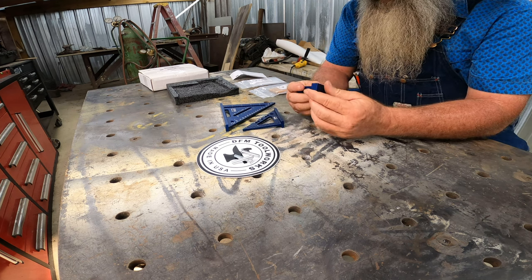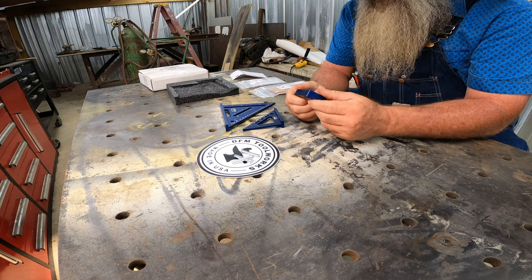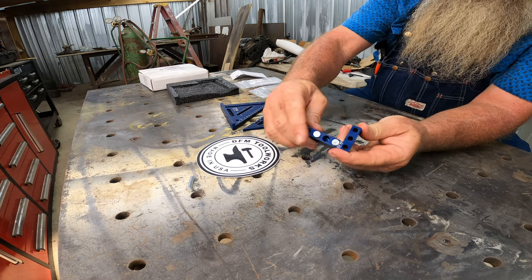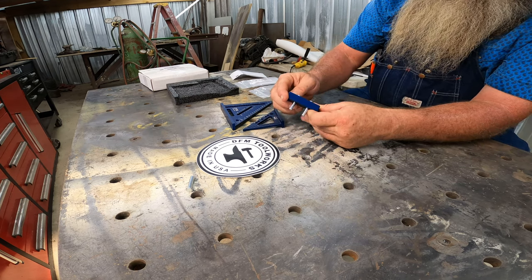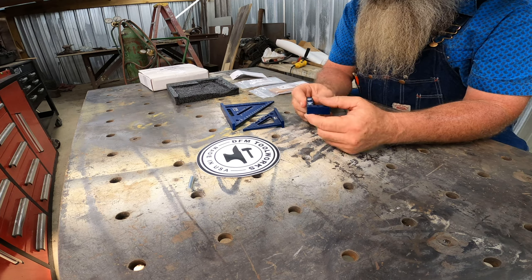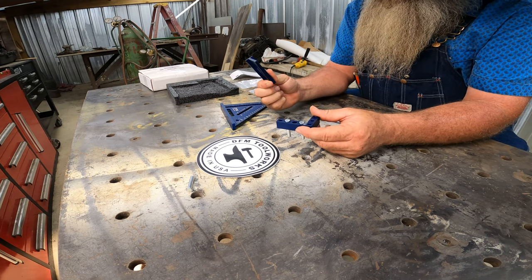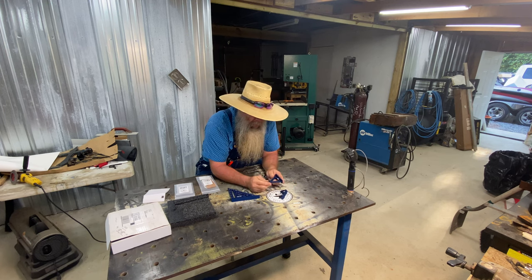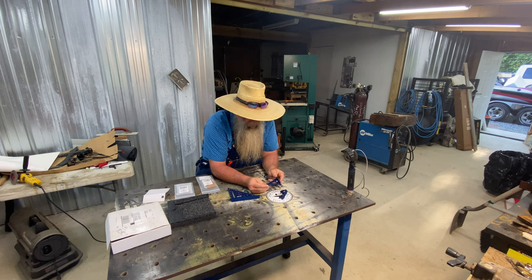They're real light and they're just real nice. On this piece right here, you could drop this pin in on a small board, put your mechanical pencil right down in the middle of it, and scribe you a line. Find your center on a small board — like a three-quarter board in woodworking. Pretty neat. You can use these pins for alignment too. They also go inside of the little small square. If we look at this small square, we've got all kinds of little holes for your increments to be able to scribe. You take your mechanical pencil, drop her down in one of them holes and scribe. We've got a three-inch scale on there and it looks like every eighth inch has a hole machined right into it.